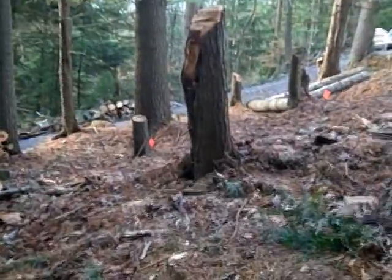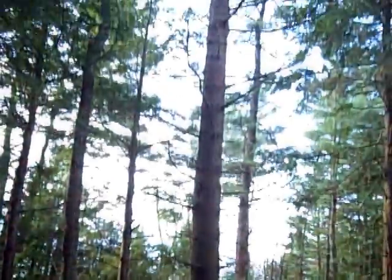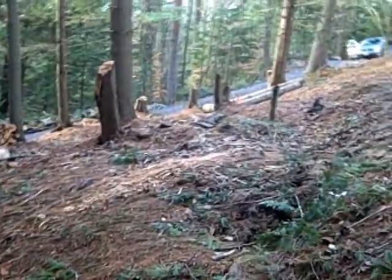These are where the septic's going to go. I left most of the stumps up high so that it'd be easier to dig them out, push them over. I don't exactly know where the septic's going, but it's in here somewhere. I've got to make a level spot, and I don't want to hurt that tree if I can. I have to be 12 and a half feet from the property line, so I've got it blazed on a tree. Pretty much where those orange flags are — it's 12 and a half feet. I don't know if that big hump is a rock, in which case it's going to be hard to deal with.